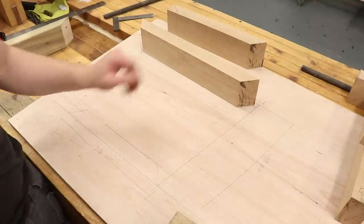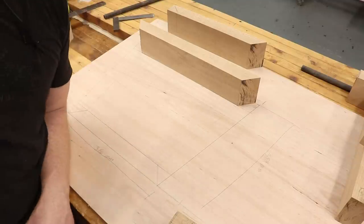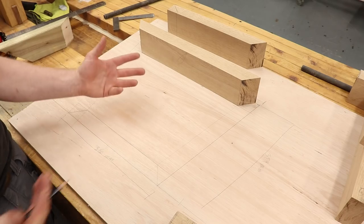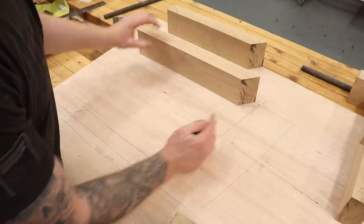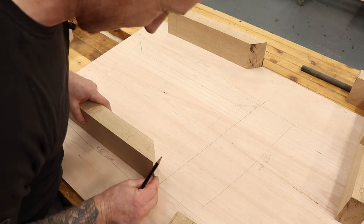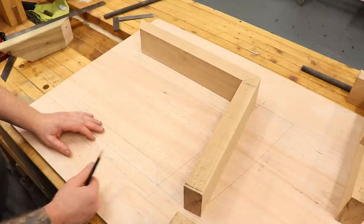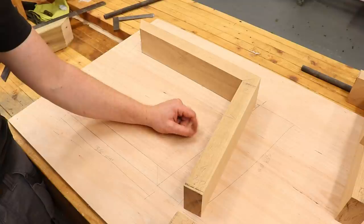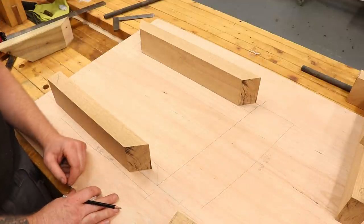I've made a booboo and I thought I was going insane for a second. Something very strange has happened — I've discovered something about mitre saws that I didn't quite understand. This is a teachable moment. I have an 80-degree angle, so half that is 40 degrees. I cut at 40 degrees and I end up with a 50-degree cut on my piece of timber. 50 degrees is what I need for the bottom, but not the top — I have two 40-degree cuts where I needed 50-degree cuts, even though I set the mitre saw to 40 degrees.